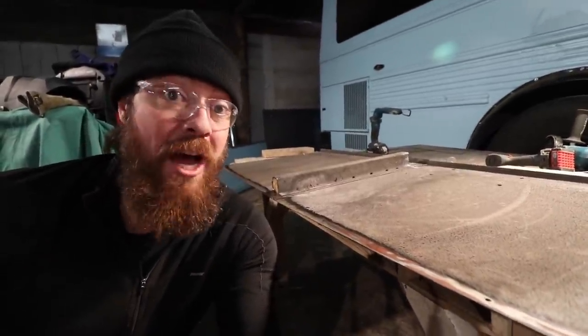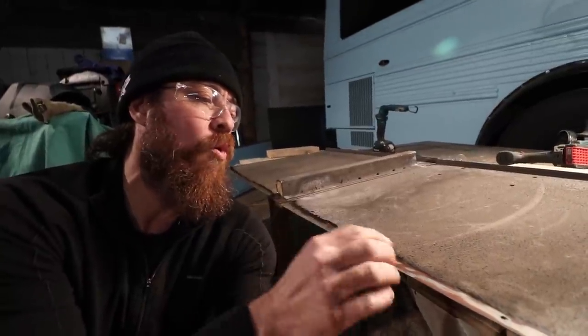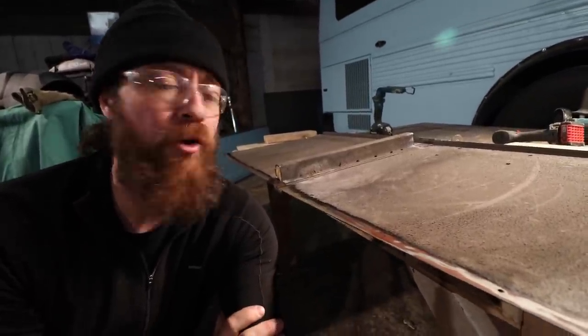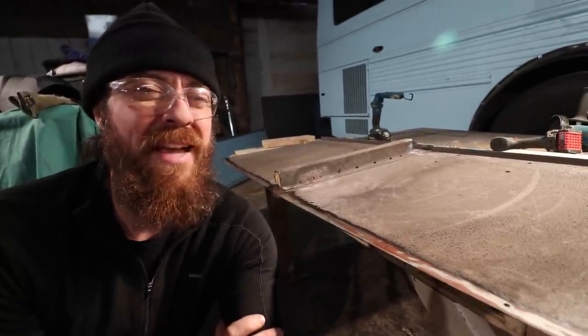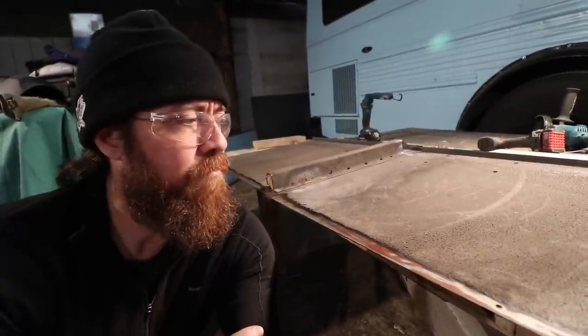And it'd be nice to have that top edge seam sealed. We're gonna weld the other edges. Cleaned it off with some mineral spirits. Now it no longer feels oily at all, and it's down to bare metal slash kind of maroon primer. So I think that we'll probably continue to do that because that top edge would really benefit from having seam sealer on it. Another option would be to caulk that top edge once it's mounted. I don't know. We'll explore and see what works best.